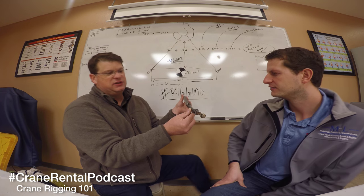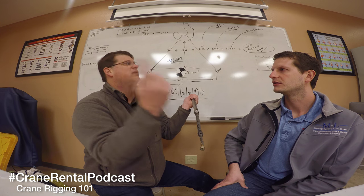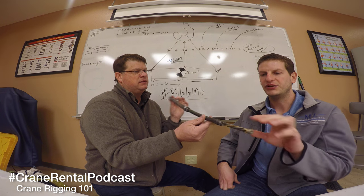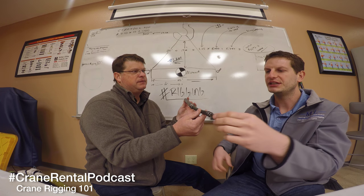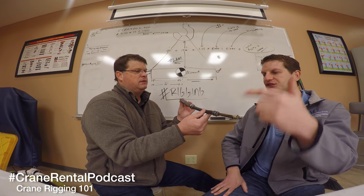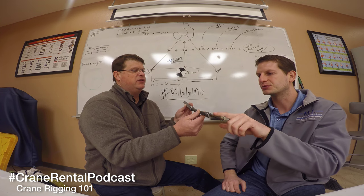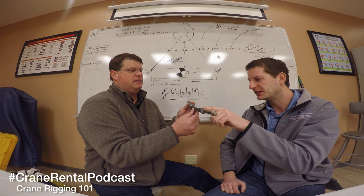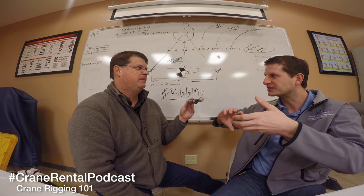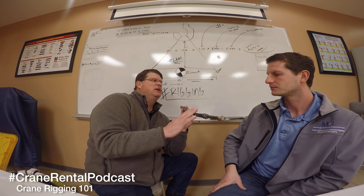This other breakdown is what they call rotation resistant rope, which is what you'd most likely see on the winch cable of a crane hoist line. This wire rope is not to be used for making rigging slings. The intention of this rope is that if you used a regular rope and picked a load on it, it would want to spin - it wants to unravel itself. This works against itself: each lay is wrapped the opposite direction of the next, so it uses physics to keep it from rotating - that's what rotation resistant means. It's mechanical in nature and works against itself.